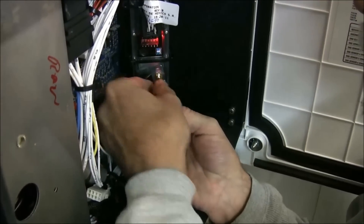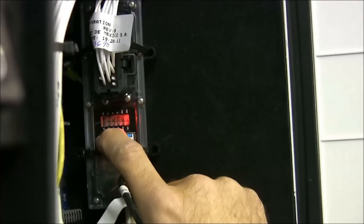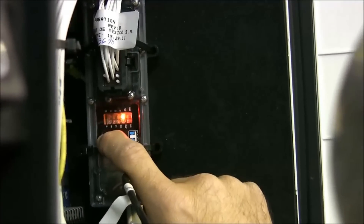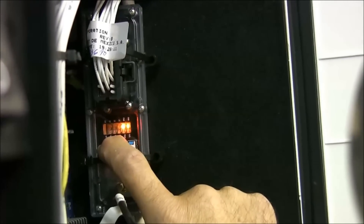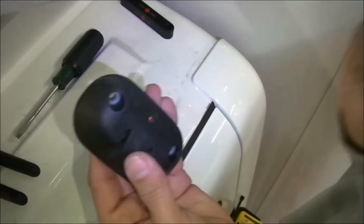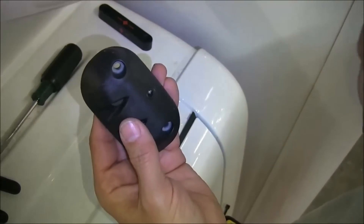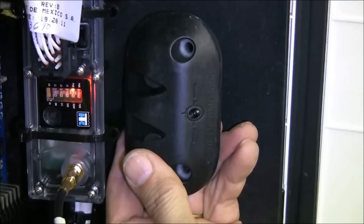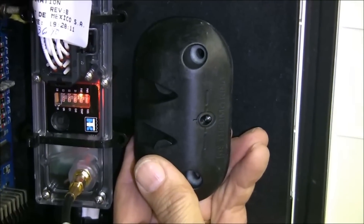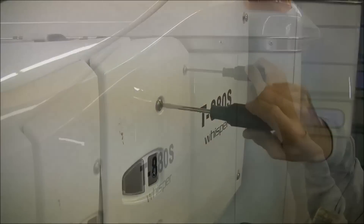Verify the red power LED is lit and press and release the switch on the module until the desired yellow zone Z1 LED is lit. Press and hold the switch again until the green pairing LED is lit. With the red, yellow, and green LEDs lit, bring the door switch and magnet together quickly two times — the LED on the door switch will flash yellow four times, then green. Bring the door switch and magnet together again three times within 10 seconds. The green LED on the door switch will turn off and the pairing and door switch LED will flash slowly when paired successfully. Repeat using different zones for additional door switches. Close and secure all fasteners on the Thermo King access door.